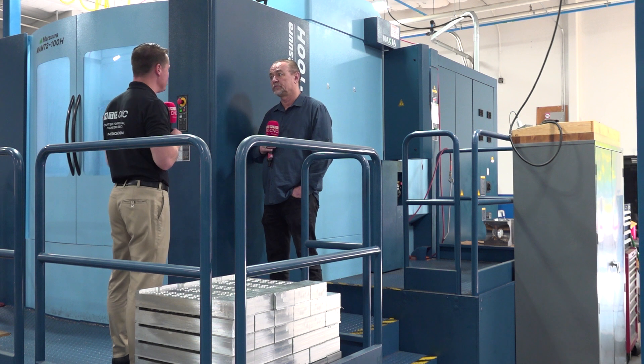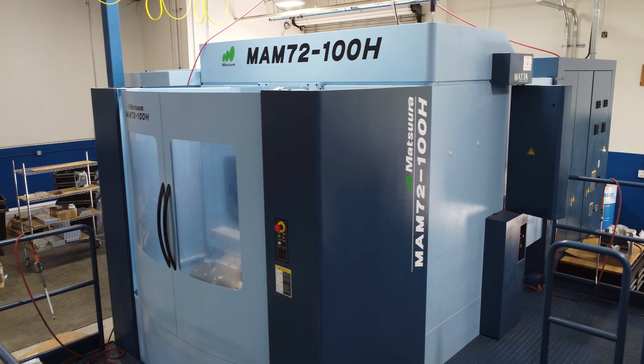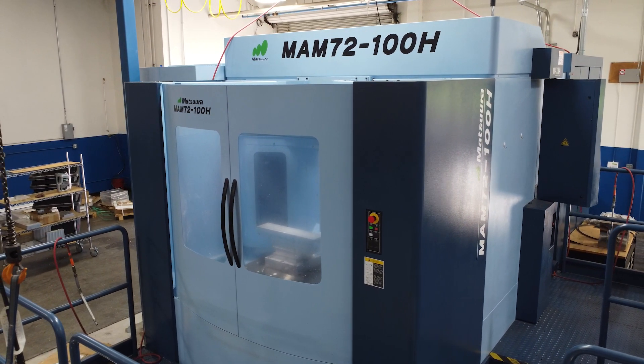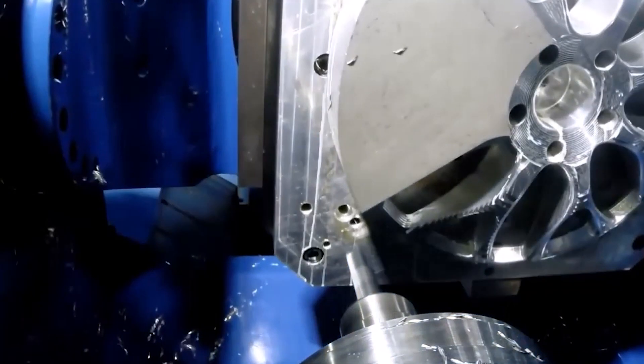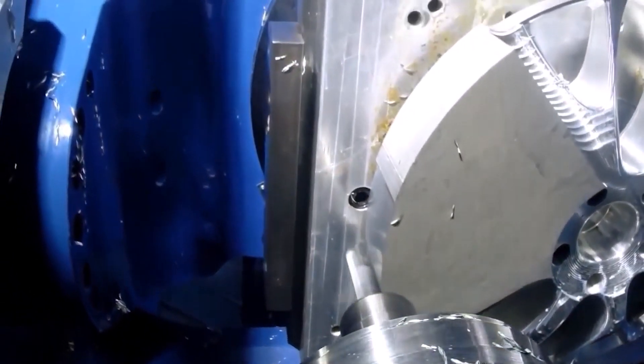That's impressive, and I know that was part of the reason you jumped into buying this machine — you needed a bigger envelope. You also have to have the rigidity when you get those big parts. From what I understand about this Matsuura, there are two motors on either side of the table to increase that rigidity. Those big motors are constantly monitoring where they're at. They're so big and strong they don't even actuate the brake until they feel they need to. Most of the time, the motors hold the machine in position without the brake on. The brake is there for really strong, heavy cuts. The design of this machine is fantastic — they have scales on every axis. It really is accurate.